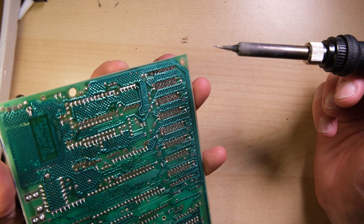Let's turn our attention to the case. As I said, the case is in pretty good condition — it has all the parts and it's pretty clean. The keyboard membrane had died, but I do have the rubber bubbly thing and the back plate. I have a pile of newly manufactured replacement membranes, so I'm going to put one of those in. But first — should I clean it? Looking under the keys, checking out the grime, I decided I should — so all of the keys are going to have to come off. All the keys, the white knobbly bits, and the top half of the case itself are going to a warm soapy bath in the sink. After a bit of attention with a microfiber cloth — it looks miles better. You just need warm soapy water and a cloth.